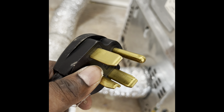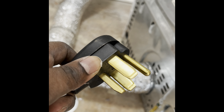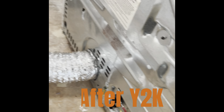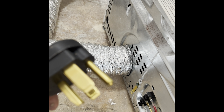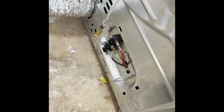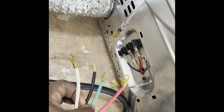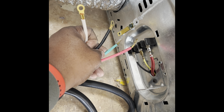The government decided to change them from three prongs to four prongs — I want to say in the 90s. You'll find these on dryers and I think ovens. So if ever you need to change something out, that's how you're going to do it. They're normally color coded for you. This one for some odd reason has yellow in the middle, but when you're doing something like this always remember the white goes in the middle and the green one is going to be a secondary ground.